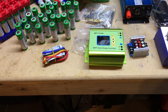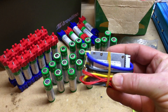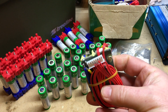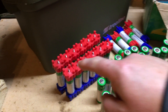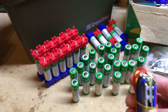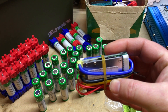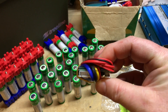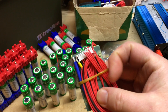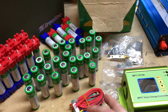Let's take a look at the BMS for the battery. This is essentially the brain — it controls the charging and discharge. It's also going to charge each string and balance it to make sure that each cell is in balance with each other. It'll have seven cells in series. It's smaller than I thought it would be, but this is something new for lithium. If you've never worked with lithium, you definitely need to have a BMS on your packs. I'm looking forward to hooking that up.